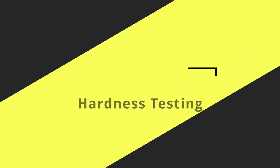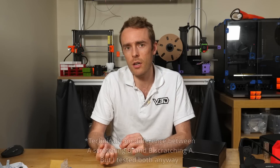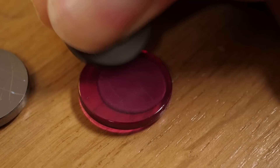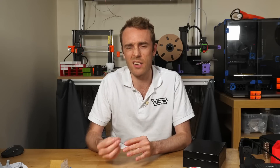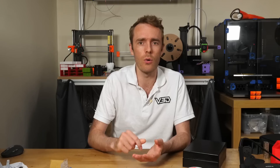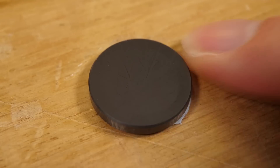What about hardness? Using the same disc material samples, I attempted to scratch each material with the diamond and then vice versa. The brass, steel, tungsten, and ruby were all scratched easily by the diamond. When done the other way around, it looks like scratching but you can just wipe it away — it seems to just be distributing surface oils. The diamond disc was essentially left completely unmarked.